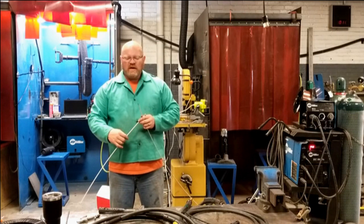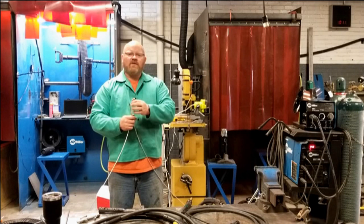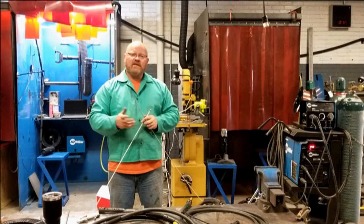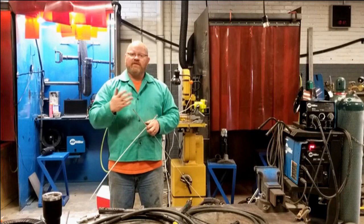That's how this one was damaged at school — I saw it happen, and immediately feeding problems resulted. We pulled it out and sure enough, there was a kinked liner. Additionally, other things can fill the liner with dirt and debris. To some degree this happens naturally: the wire, while energized on your wire feeder, becomes magnetized. Small particles of dust in the air cling to the wire, and as the wire passes through the liner they become trapped, effectively filling it full of debris.